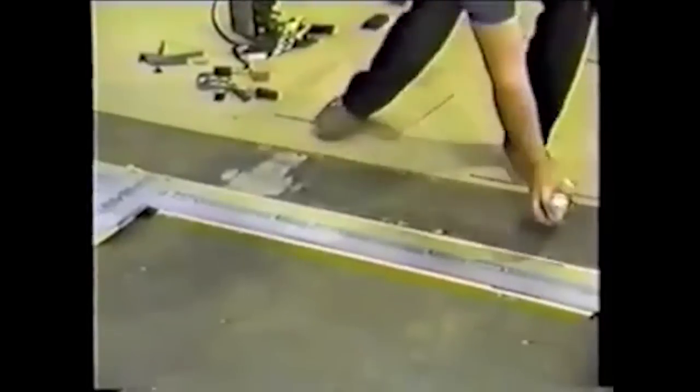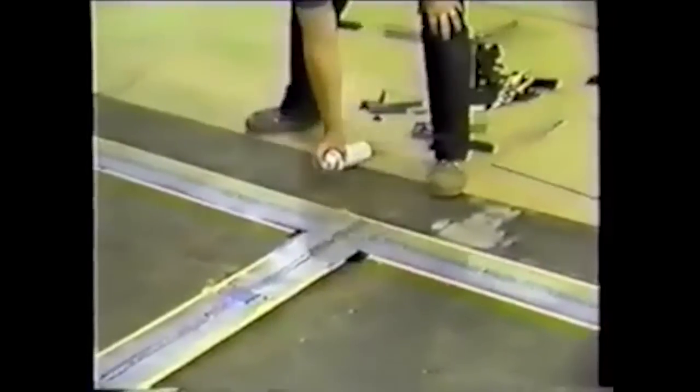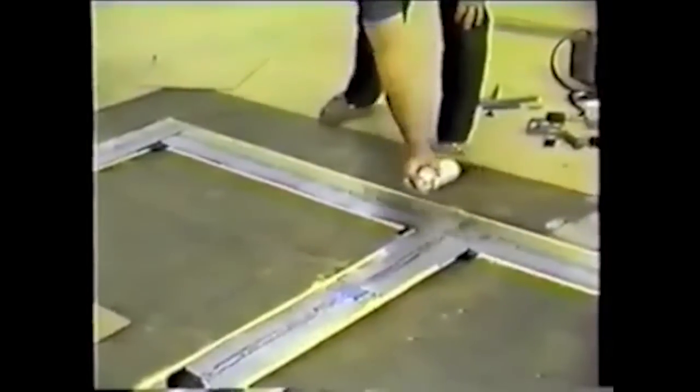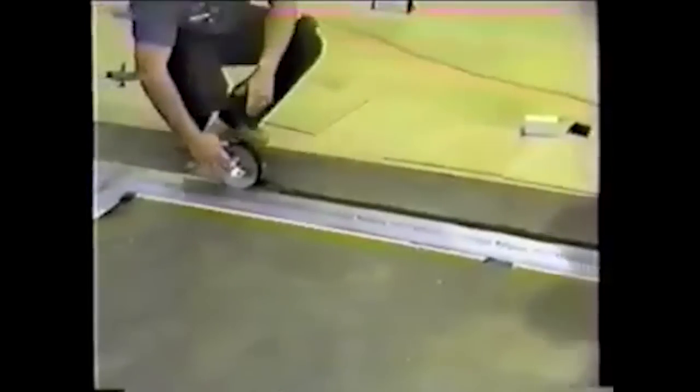Using the spray adhesive to securely fasten the hold-down tape to the floor, spray the floor along both edges of the vinyl floor preparation for the entire length, or if floor preparation is not required, along both edges of the top shield. Tape the edges of the top shield and the vinyl floor preparation, if it was used, to the floor along both sides of the completed cable installation for the entire length of the cable run. By hand, assure all hold-down tape is securely fastened to the floor.